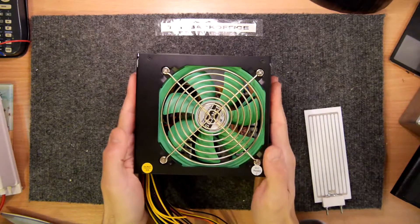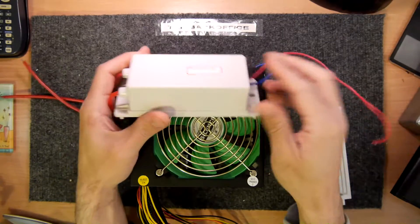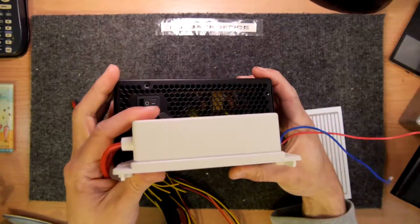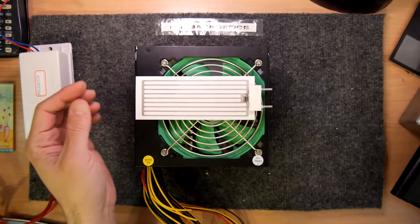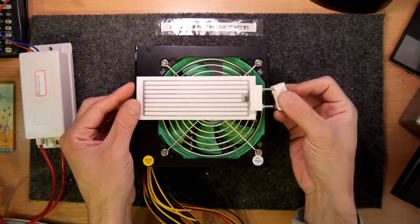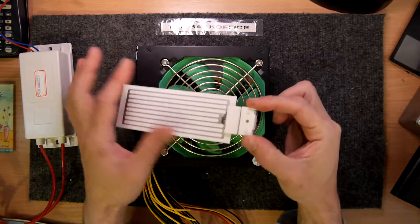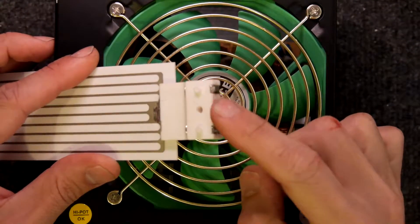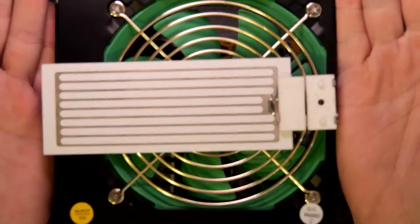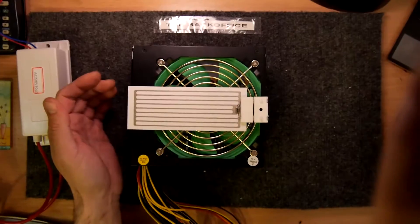There are some issues with this. You've got your unit here — it's got all those bits and pieces, so in that box you have to mount this huge transformer. If you look at the depth of the unit that's going to be a little bit tight with that fan, but it can get in there — that will fit. I can just about shoehorn that in, and then you've got your plate. This plate normally connects to this connector block which solders onto those HT leads, and that whole thing is clearly too long. Not only is it too long, you've got your solder ends here which are going to short out the edge of this case. Sorry about the colours — black on black on black — it's quite hard to see but we'll battle through it.